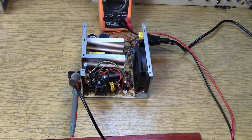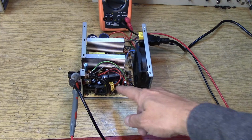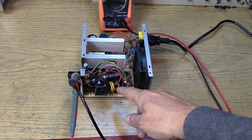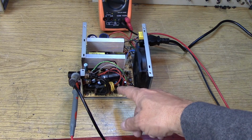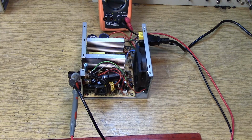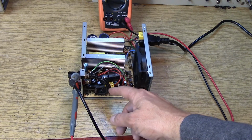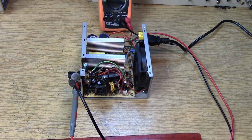So first of all, I took all of the yellow wires that I could find, turned out to be 7 yellow wires, and paralleled all of them and brought them to the fuse. I have a fuse holder that's capable of handling 25 amp fuses. I've got a 20 amp fuse in there. I counted the same number of black wires as yellow wires for the return.